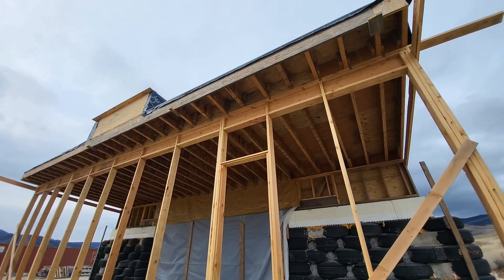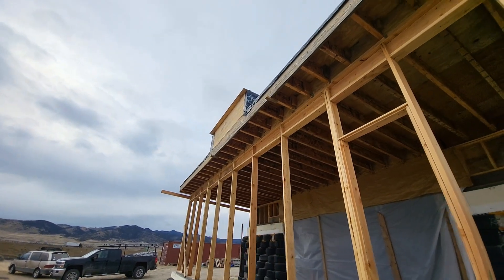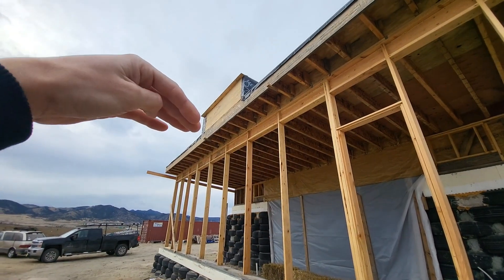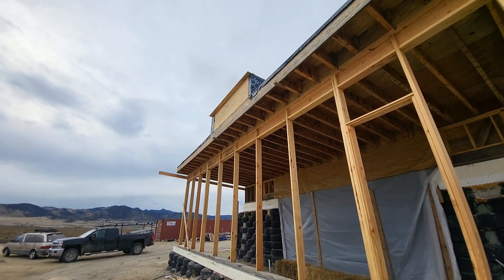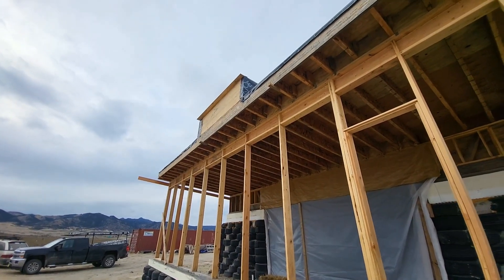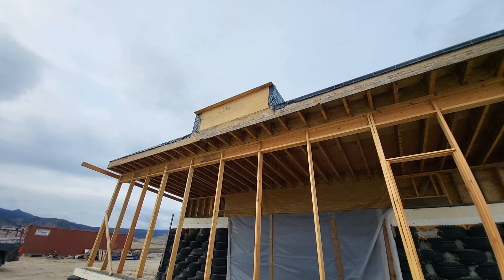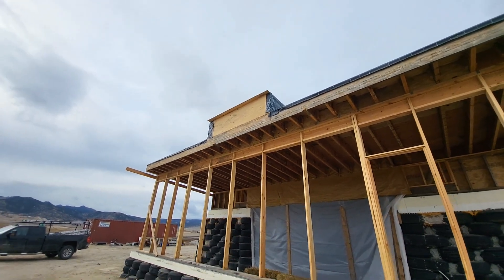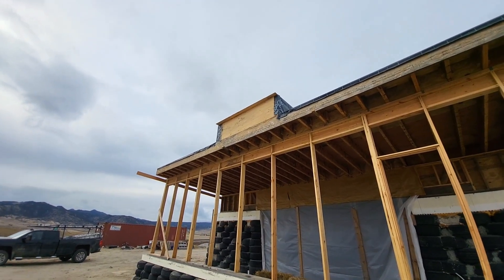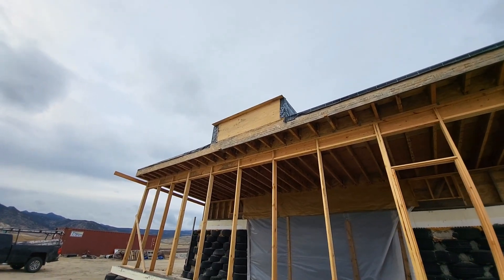I finished the roof off — just wanted to show the overhang I have here. You can see that skylight box is actually over the overhang. The reason I did that is I didn't want to set it back because then water or snow could sit in that seam — it'd be a potential for a leak up there. Because of that, the skylight box is way bigger than they usually are. I might switch it up in the spring. I was thinking about instead of having it plumb like it is right now, maybe putting an angle on it so you can mount either a solar panel or solar hot water or something. I'll think on that over the winter.